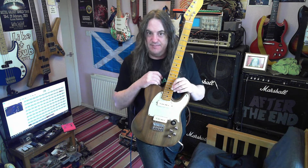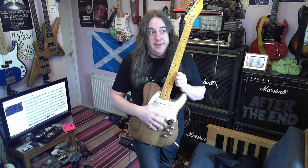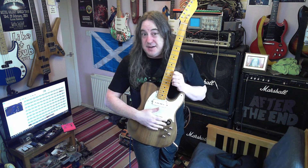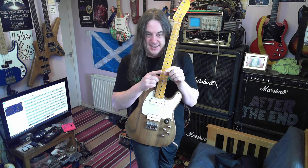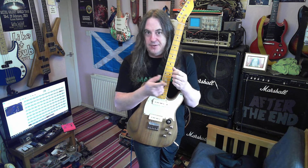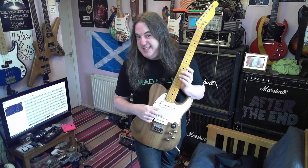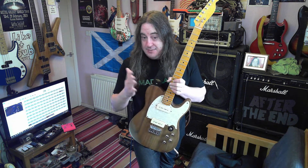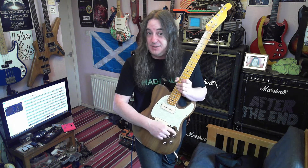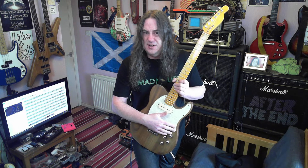So now working. I'm not going to charge for doing this — it's a sort of mates rates thing through the shop. Basically just cleaning up the wiring makes a big difference. All the wires had obviously been on and off about 20 times and it's really big strangly bits, and you could kind of see when you get your shielding wire around cables and it kind of all frayed, so there were wee bits that were kind of leading out and touching other things. I couldn't really diagnose what the problem was. The switch was knackered, so I had to put a new switch in it — the one that was in it was just intermittent.